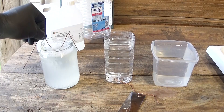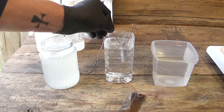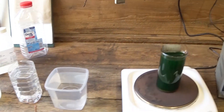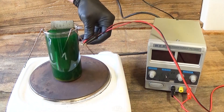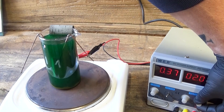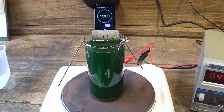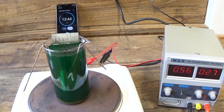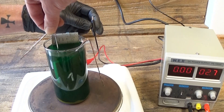The piece is dipped in degreaser for about one minute, then cleaning in distilled water. The negative pole goes to the material to be plated, and the positive pole goes to the piece of nickel. I keep the electric current at about 0.6 amps. All pieces I have been nickel plating for 15 minutes. In the case of electroplating, I turned the material to the opposite side at half of the time limit, so that both sides face the nickel piece.